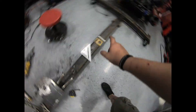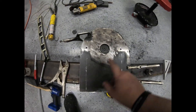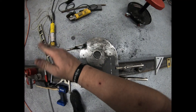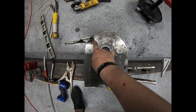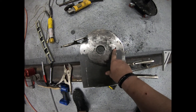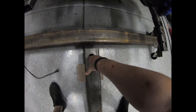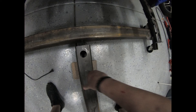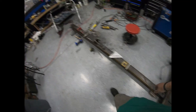The pin would go straight through the plate, straight through all the way to the bottom to lock this into position. I already made the outline of that template on my steel over here, as you can see. So I just have to cut this up — I gotta make two of them. I have enough space over here to do that. So far I got this plate going — it's actually gonna go over there by the T, and what's gonna happen is this is gonna be a center pin for this main arm. The arm is basically gonna move right and left, and I can lock it in with pins. These are just the pilot holes — they're gonna be much bigger when I'm done.